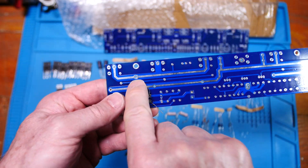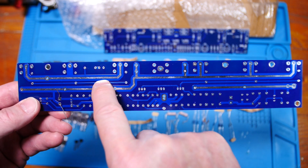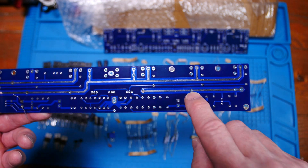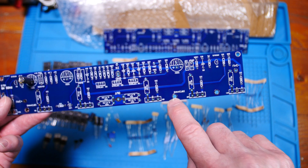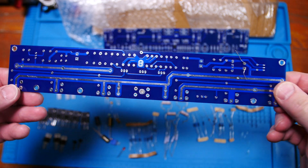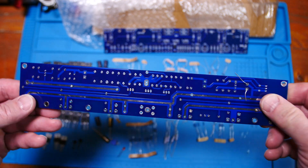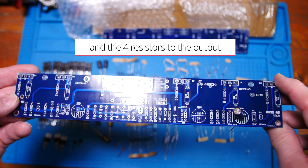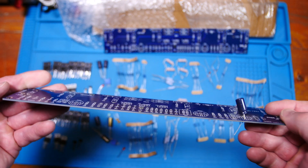Here's the picture of the whole board: plus voltage in, minus voltage, output, input, ground, and the XLR input. The plus voltage rail connects across to all three transistors. The minus voltage runs down to the three current-sharing resistors and the three FETs connected to them. Then this center connection links the three resistors on this end and connects to the three transistors on this end. You can see the ground going off to all the different parts.